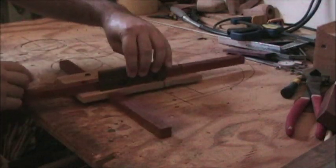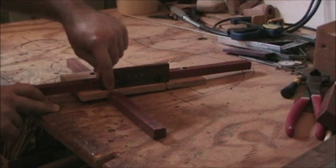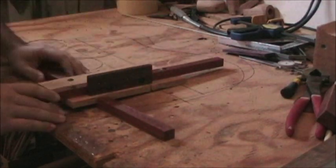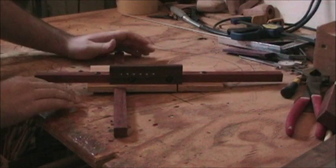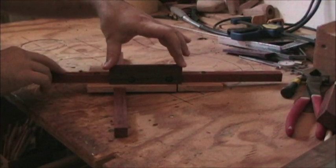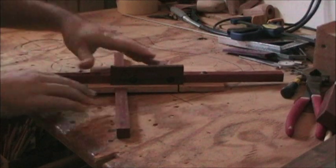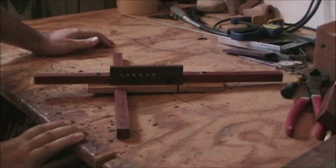What I did was attach this other little piece to the front here. What this does is it raises the amount of space I have here a little bit, so that way I can actually take two strips and press them up against here as I am running them through the bandsaw — so you get double the action for the same amount of effort. When you are making kerfing strips, it is going to get boring, so definitely make it so you have an attachment like this. This board back here just needs to be at least this tall and 90 degrees to the slider board. Let's head over to the bandsaw and I will put a blank on and explain how it is done.